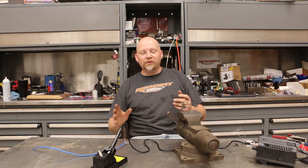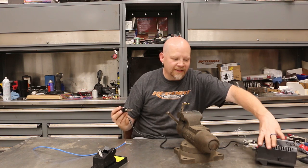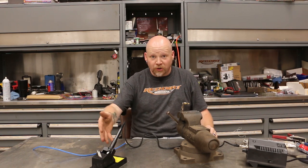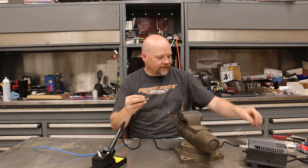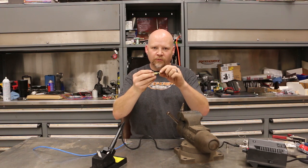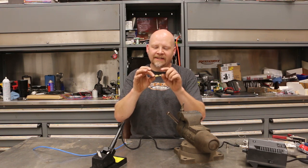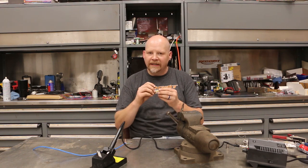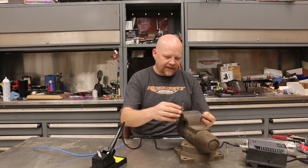To do this you need a few things. First, you need a soldering iron — I prefer one with an adjustable temperature range, which gives you better control so you don't melt your RCA jacks. The RCA jack comes with a little collar that threads off, a ground post, a center pin, and plastic on the inside that insulates the center pin from the outer pin, which is your negative. If you use a regular soldering iron it's really easy to melt that plastic and ruin your pin.